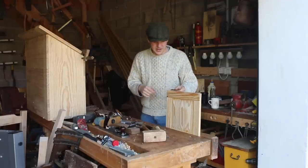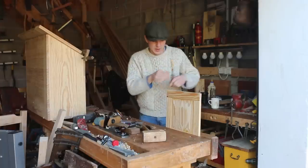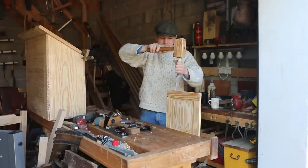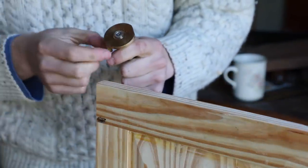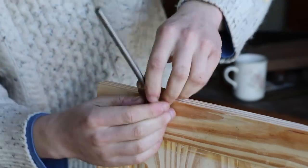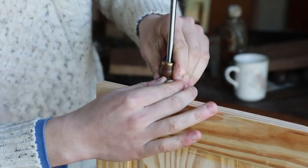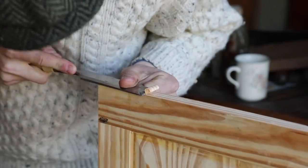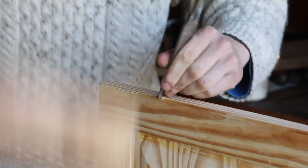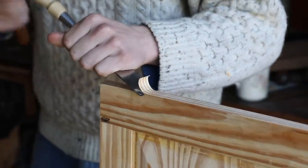It's been a few hours and it's back in action again. I have the hinges here and I'm just going to line them up, find where they meet the edge, and come along with the mallet to lock them into place. I'm also going to set the marking gauge to about the thickness of the hinge itself and then transfer that onto the wood — good and deep on both sides. Then I can carefully come along with the chisel and spend a few minutes shaving down to that line. If I go bevel-down I might go a bit quicker.